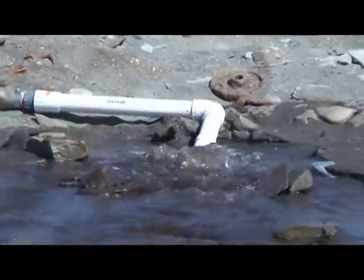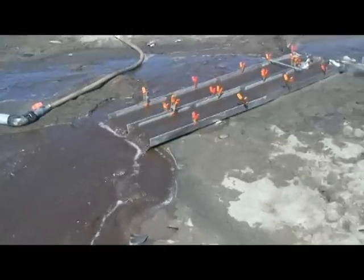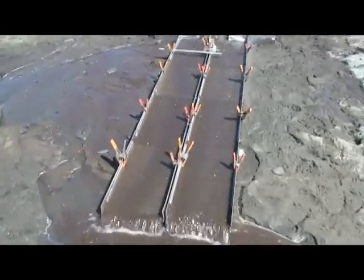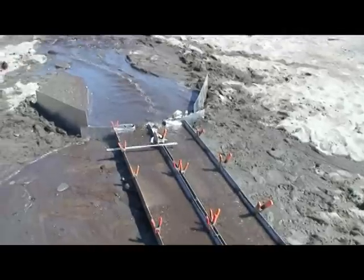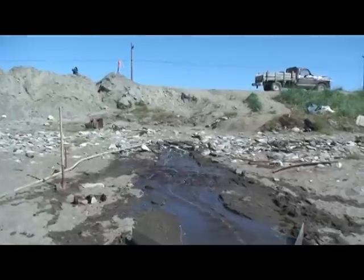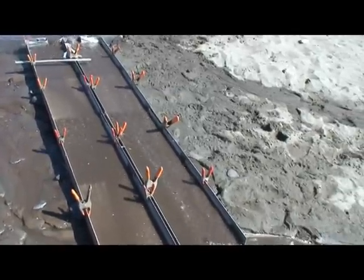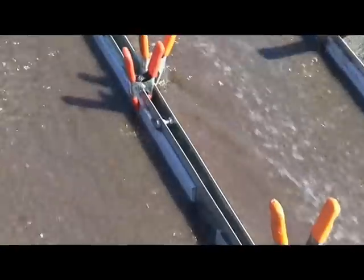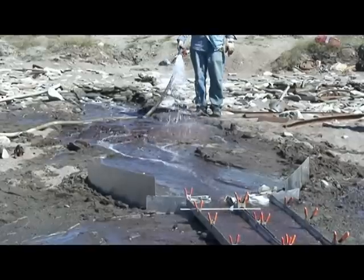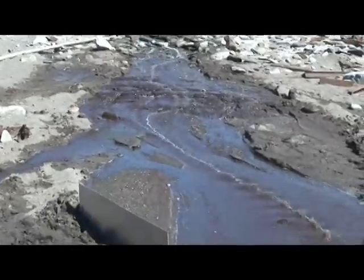We've got our wash water up here coming down over the clay. The top half of that area is now exposed clay. The manifold is up here; this has been going for probably an hour, a little more. There's no additional water at the top of the sluice anymore — just tuned it so the amount of water coming down at the very head carries just about the amount of material the sluices can handle. Streaming down nicely, pretty much steady state at this point. We'll just keep on running and see what happens.